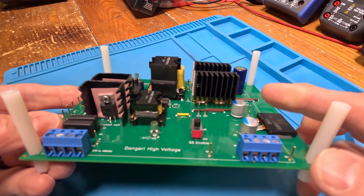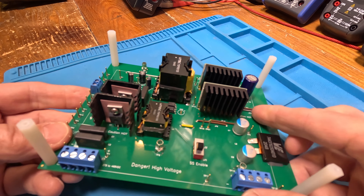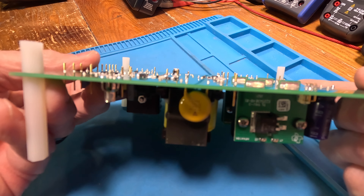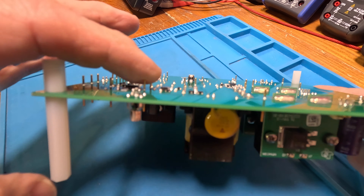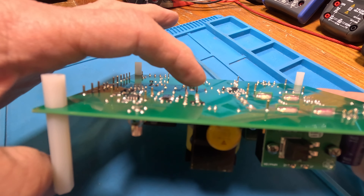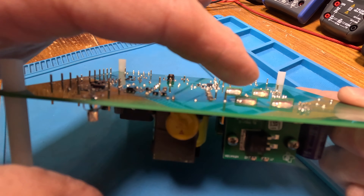You can see the test pins all over, even on the other side - they protrude so you can fairly easily clamp onto them. On the back side there's not a whole lot, but looking closer this chip right here is the control chip running the whole show. It looks pretty simple - there might also be a gate driver, current sense, and an op-amp chip.